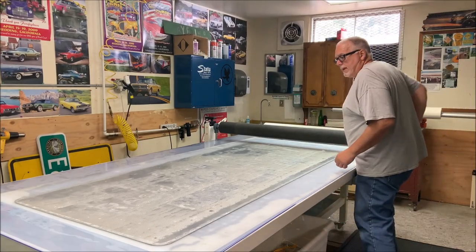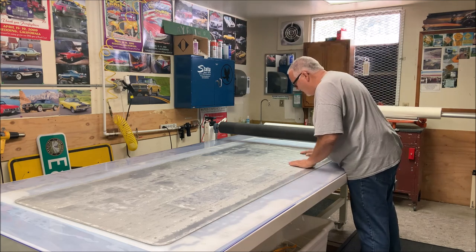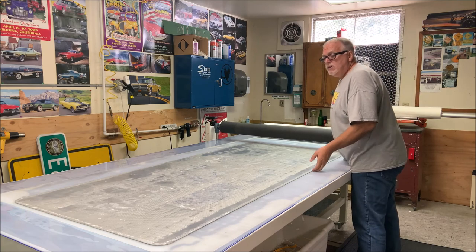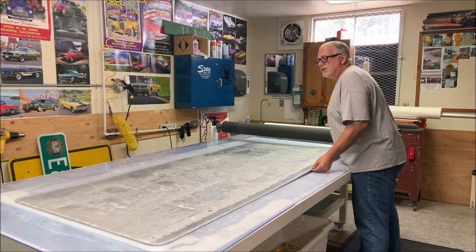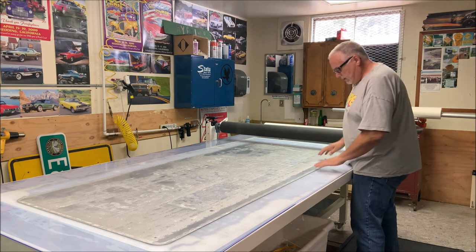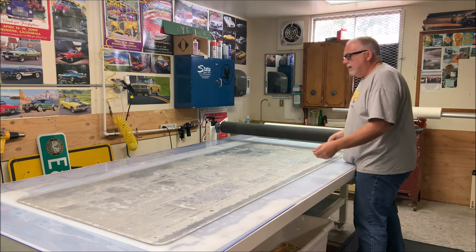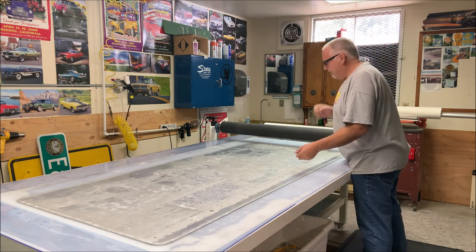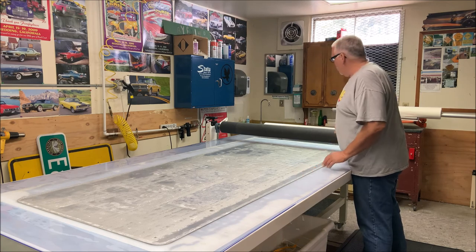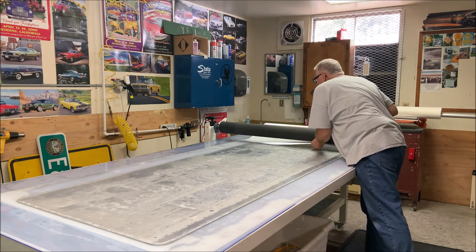Okay, here we go. I have my sheeting all cleaned pretty well. It actually turned out really nice. I would sure hate to do this to every sign that I have. We sent ours back to a manufacturer called Zap, and they strip all the finish and refurbish it. So I took it down, like I showed you, to the shop, and I took the high-pressure washer, turned the heat all the way up, and used the remover to remove it. So now what I'm gonna do is roll out the sheeting.